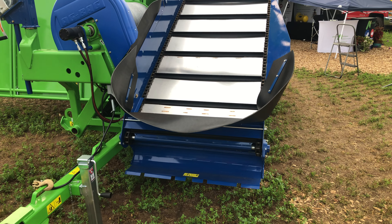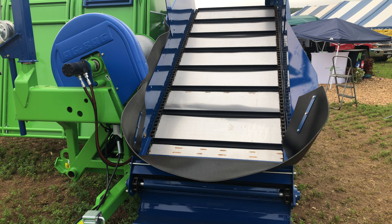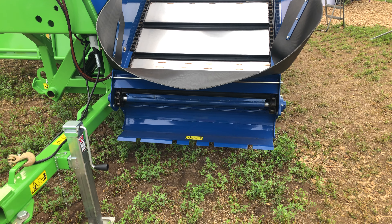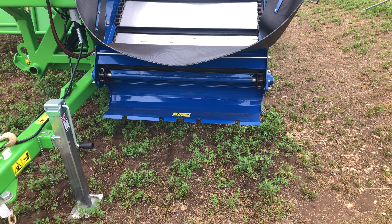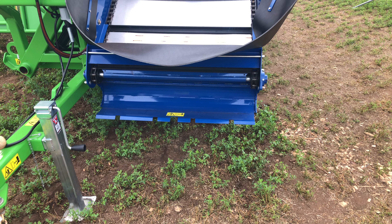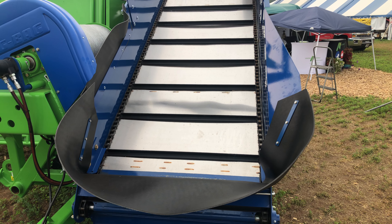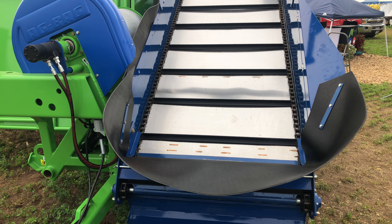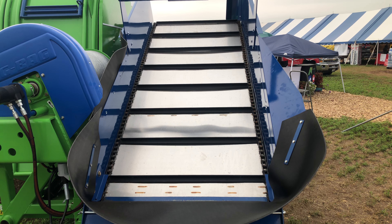We also have a wider single conveyor for the machine. This is to allow for more throughput, especially in lighter conditions and lighter crop moistures. We also have the open door design on the bottom of the conveyor, along with rollers and a skid plate underneath the end of the conveyor to ensure quiet, reliable operation. We have a stainless steel replaceable floor underneath the chain of the conveyor to ensure long life, less abrasiveness on the material, less drag, and less gumming over time, allowing the gummy material to break off as it dries.